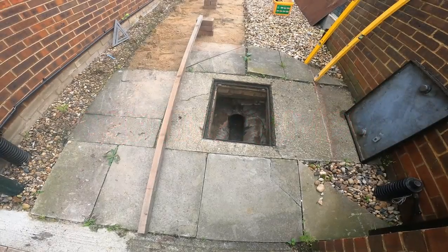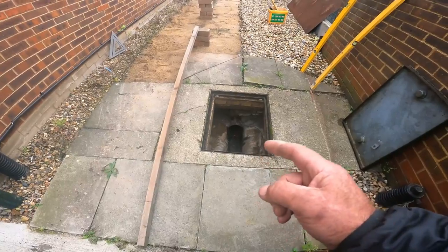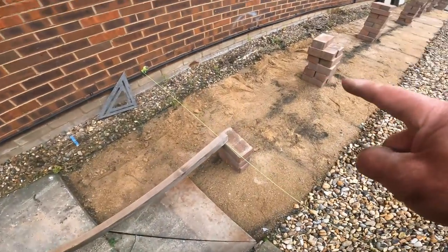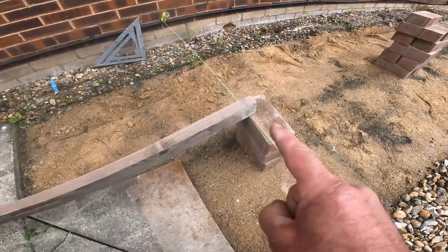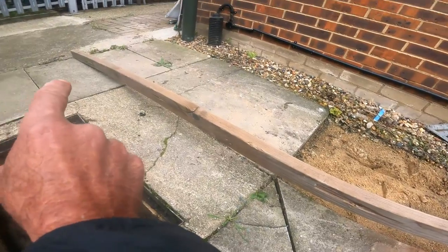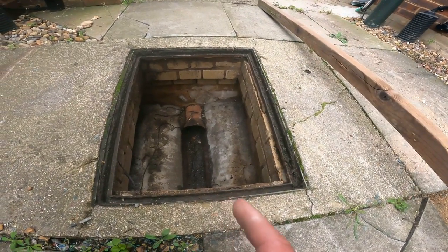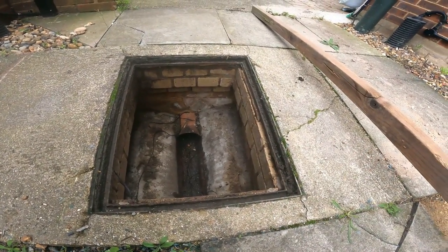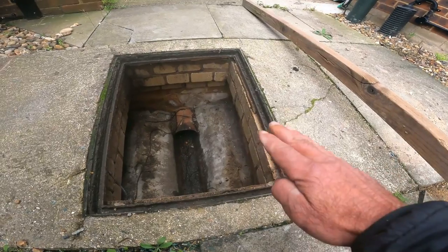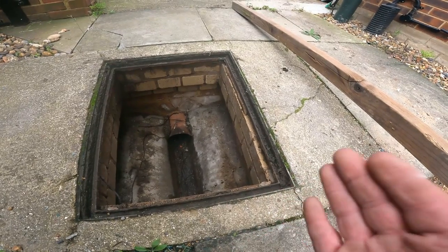I'm Creative Cranbo back with another one. I've got to try and get a ramp in this area here. I've got a manhole there to bring up as well. The reason I'm doing a ramp here is that I've got a pathway there — that's the height of the pathway — and then my ramp will fall that way and meet up with the concrete path down there. I've got a bit of brickwork there as well, so I can build off that. I've got two options: I could do it in brickwork and cut down the bricks to suit the ramp, or I could do it with a concrete chamber and cut that down to the same height of the ramp.